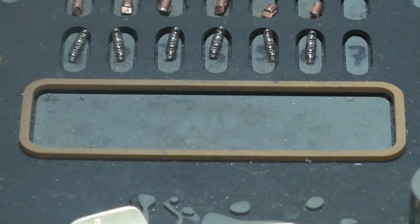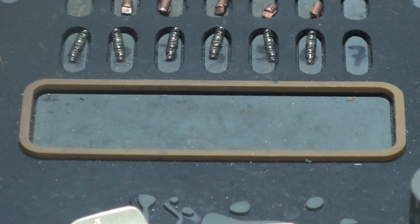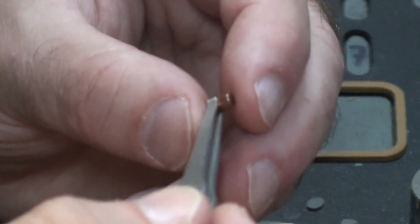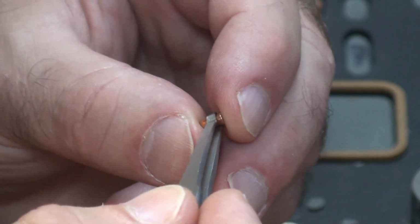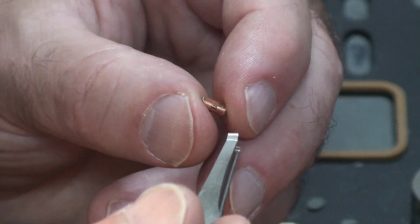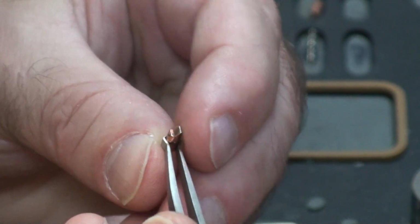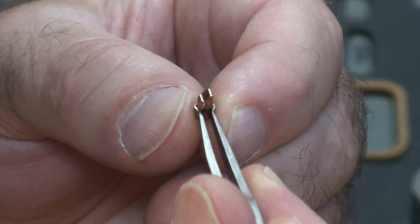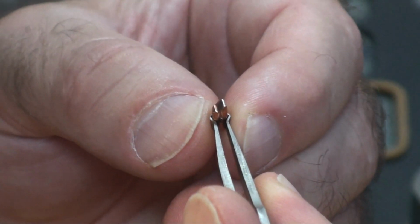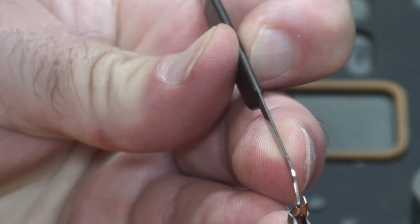Now, this is where the D12 history comes in, folks. This system first came out with the D12. Okay, the pins are not regular symmetric pins, so they don't come to a conical point like every other pin does. They in fact come to 2 different points. So you can see that the pin is kind of chisel tipped like that, and it has got 2 peaks to it. It's got a long and a short peak.